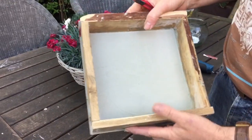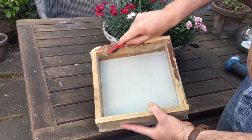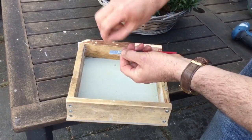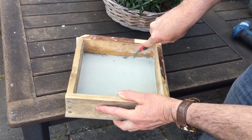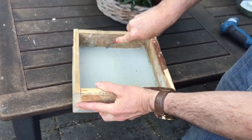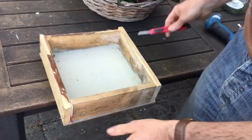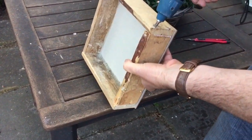This has had about 10 hours to dry so it's nice and hard. I'm going to run a knife around the edge to give it a better chance of separating cleanly. It's a flexible knife where you snap individual pieces of blade off to renew it - quite long and flexible, so it enables me to get down the side and hopefully release the mold a little better. I won't go too harsh because I'd cut into the wood and spoil the mold for next time. It's been a hot day so it's well set.